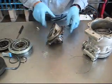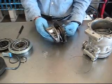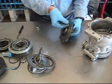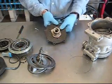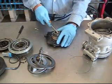Next, we want to get our front seal out of the nose housing. Simply push out the driver assembly and, keeping track of your bearings, lay them in order for easy reassembly. That will expose the front seal.